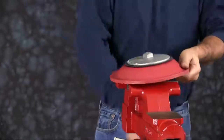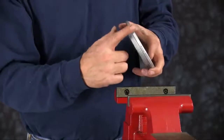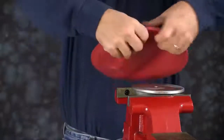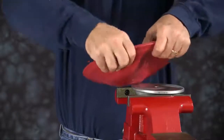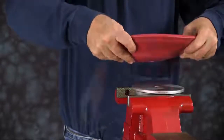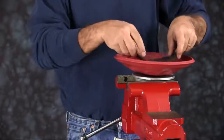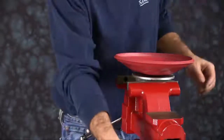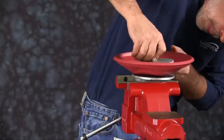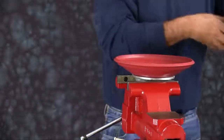I'm going to do this for both diaphragms. Go ahead and put the inner plate into the vise. Make sure you grab onto the bottom of the plate, flat face up. Invert the diaphragm, set the diaphragm on there, put your wear pad on, and then thread your outer plate into the assembly. Torque to manufacturer specifications.